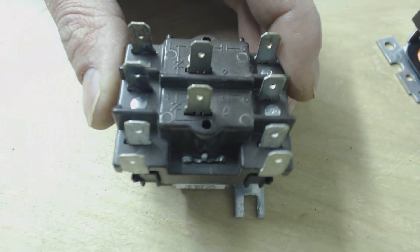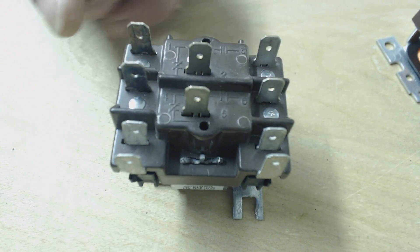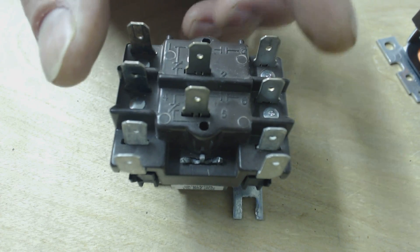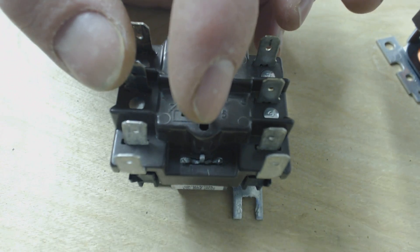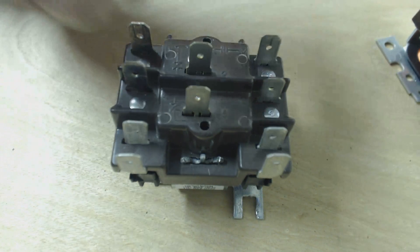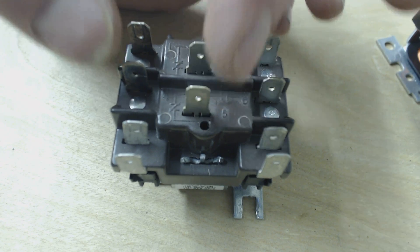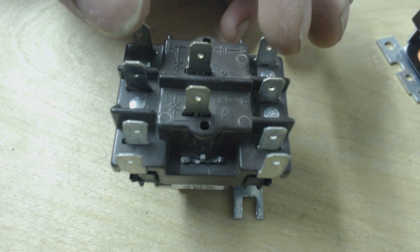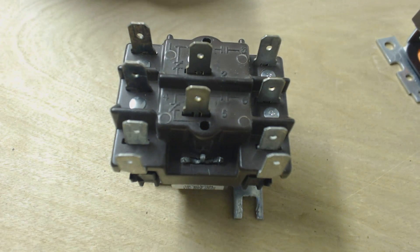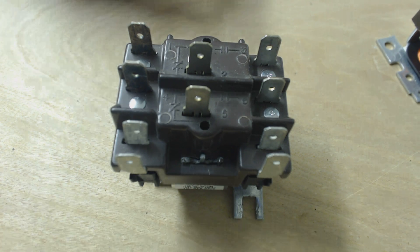The type that you would like to keep in your truck — you'd like to have two sets of contacts, so that maybe you could have one that's normally open and one that's normally closed. When you power the coil, the set of normally closed contacts will open, and the set of normally open contacts will close. So that's just a quick rundown on the general purpose relay. If you enjoyed yourself, see you next time — AC Service Tech.